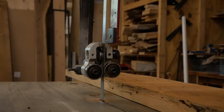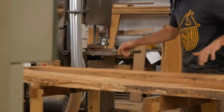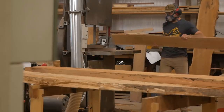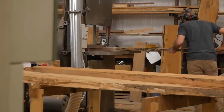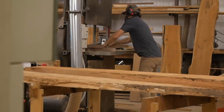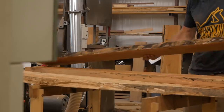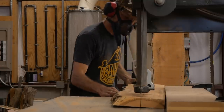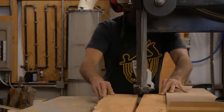The parts we're working on right now are the bed posts — obviously four posts, three and a half inches square. I'm working with about an inch and three-quarter to two-inch thick material, so I've got to laminate up three pieces to get the thickness I need. I'm knocking out six pieces at about 80 inches long — that'll get me both the headboard post and the much shorter footboard post. Once everything is straight-lined, I set a fence on the bandsaw and rough out boards at about four inches wide.